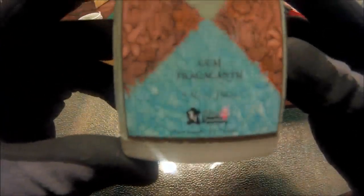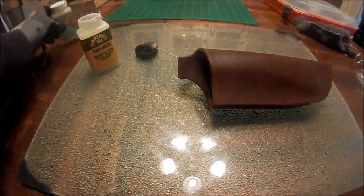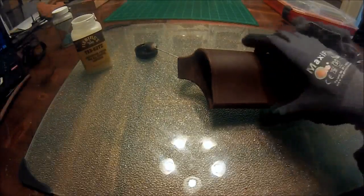So now the next thing I'm going to do is I'm going to actually apply something on the flesh side just to make it look a little nicer. Now in my last video, I used this here. I hope you can make that out, because I am not going to try to pronounce that. I've never learned how to pronounce it, and I dang sure can't do it now. But this time we're going to use tan coat instead. Now, the reason I'm going to use tan coat is because this is actually really nice leather. The flesh side is really nice and finished, and so there's not a whole lot of what I call hairy leather that I need to lay down. So we're just going to use a tan coat on this one.